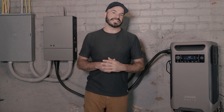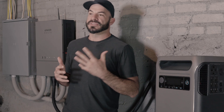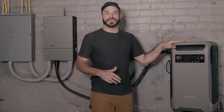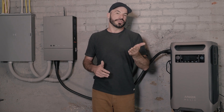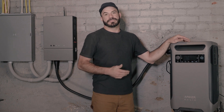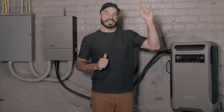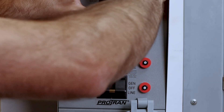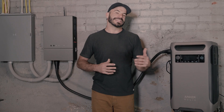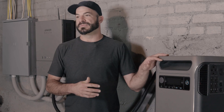The second scenario expands on the first, but this time introduces a transfer switch for selecting which loads get powered by the F3800. It's still on you to recharge the battery during the cheapest time of day, but when it's time to use that power, selecting which appliances get power from your F3800 is as simple as flipping a switch. This also makes it easier to select the F3800 as your backup power source in the event of a power outage, but it does not guarantee seamless transitions. So if you need an uninterruptible power supply, this isn't the best option for you.